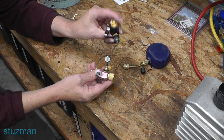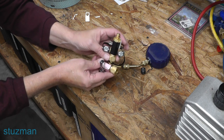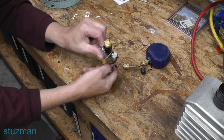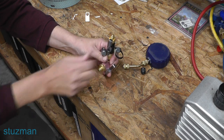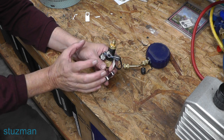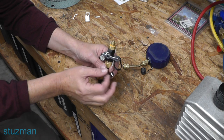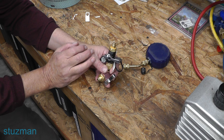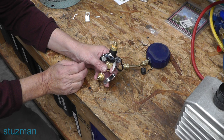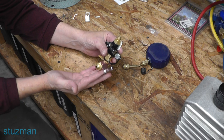When I use the second valve core removal tool — which has a quarter-inch fitting with the black body — that screws right up here on top of the test port. So I can turn that off to isolate my micron gauge from high pressure, say from the nitrogen. Before you start taking all this stuff off, do it while it's under refrigerant pressure, because it's better to have it pushing out than to have air coming back in. You might lose a little refrigerant pressure, but it's negligible — better than taking this off under vacuum and allowing air back into the system.